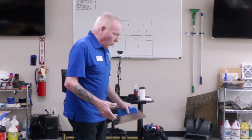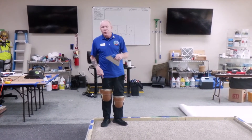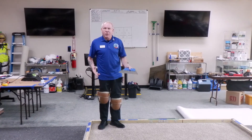You either have to cut the seam or work from the doorway in. So we're going to use position one as where the hallway and the door is. I'm going to show you another thing we can do. Let me stop and disengage this, put a buckle or two into the carpet, and I'll show you how to take them out.